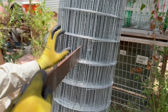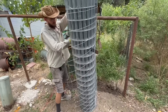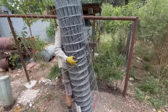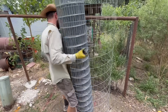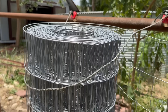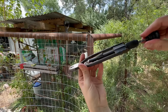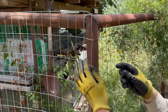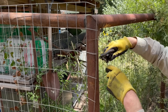To make the welded wire fabric easier to handle I pass a piece of flat stock through the roll to act both as a handle and as a device to prevent the whole thing from unrolling suddenly. To unroll it in a controlled manner I pass the steel handle back and forth to let out half a turn at a time. Then I use a piece of paracord and magnet clamps to keep the roll upright while I wire-tie the material to the pipes. This beautiful little time-saving tool is called safety wire pliers — it has a spiraling pull handle that spins the pliers around and twists wire tight. This is standard stainless steel wire from Harbor Freight. Once you've wrapped the wire around the pipe and fence material you can trim the excess using the clippers on the same tool.